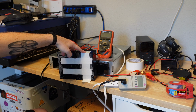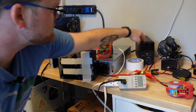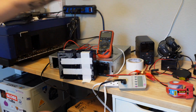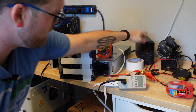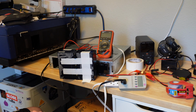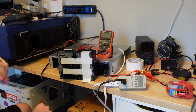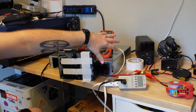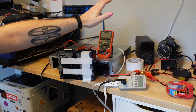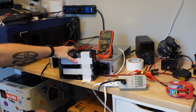I put each of these batteries on my bench power supply. This power supply, it's the same one that the guy on YouTube who overvolts the children's toys has. So I feel like I've got a little YouTube celebrity here, but it's actually just the cheapest thing if you search Amazon for DC power supply. So I'm not too proud of it. Set it to an appropriate conservative float voltage for these standby batteries, which is like 13 volts.